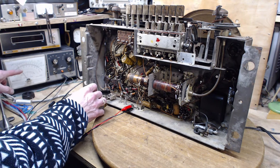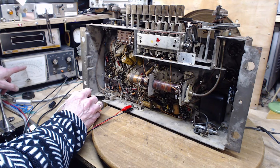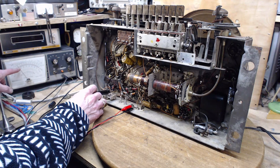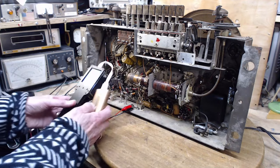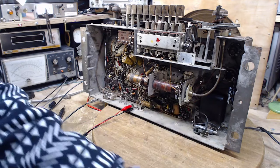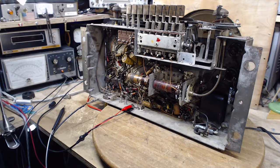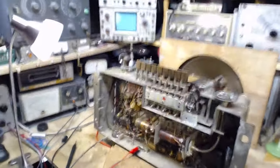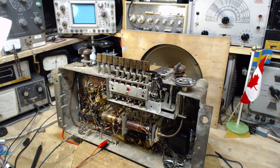And the output. So we can work out the wattage here. The voltage drop on this resistor is from 220 to 120. It's 100 volts dropping on it. See, is it maxed out in temperature? 115, 120, 130. That's too hot. That's too hot. Now, what happened on the speaker here? Let's see what happened. Did anything happen? Ice cold, because it's going to take a long time for the heat to build in that. Not quite what I expected.